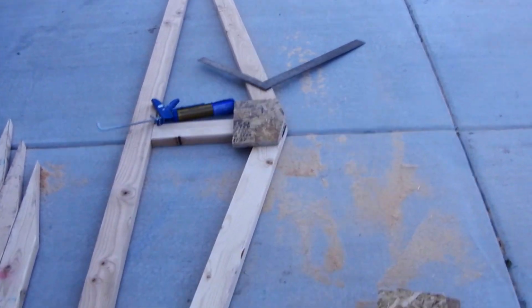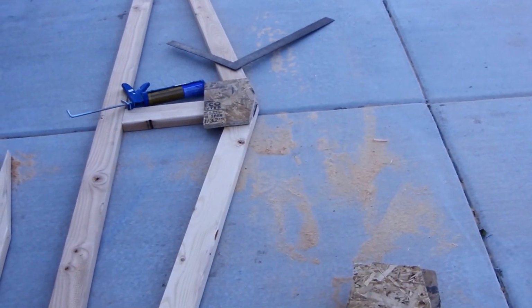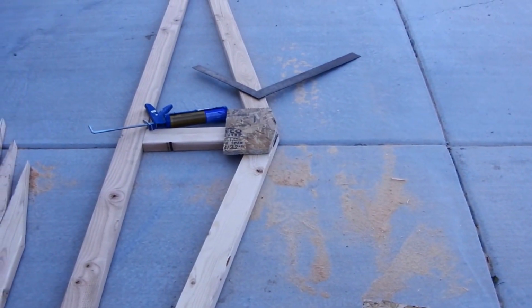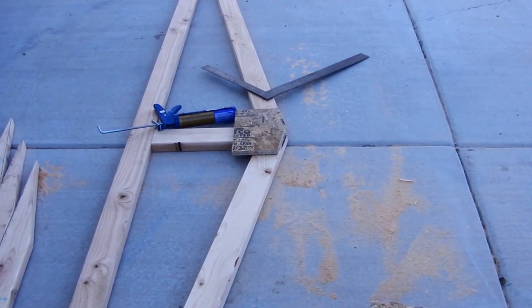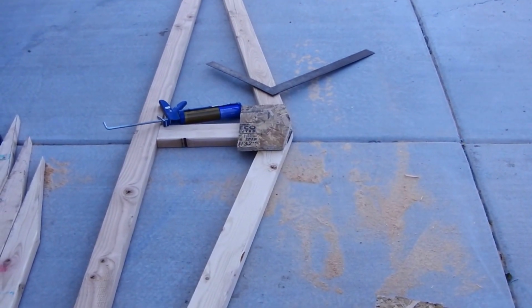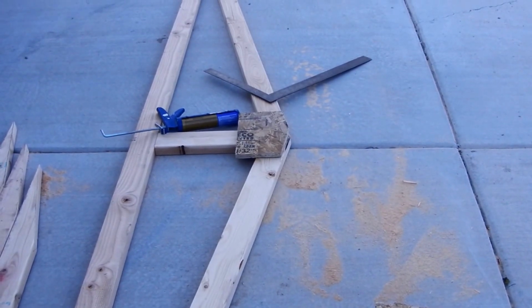So the process is I'm going to put some glue on it. 2-inch screws. So I got 3/4 inch and 1.5 inches. The 2-inch screws will give me full depth without poking through. Nice and strong. This is my first one. I'm going to make it, then I'm going to make it into a template, and then I'm going to crank them out. I need to make 12.